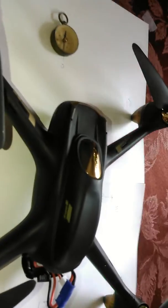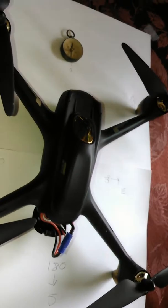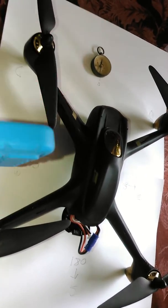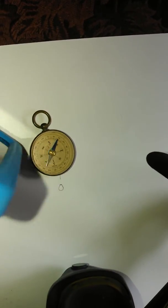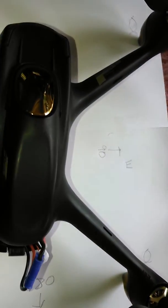The question is: can a cell phone interfere with this? Here I've got a regular cell phone. I'll put it up to the side. There's a magnet in here, and you can see I'm affecting the compass. Let's look at what's happening to the quad — we have clearly affected it. It's reading H115, which is not really our direction. I'm slowly pulling the phone away, and the numbers are attempting to return, but they're rather slow.